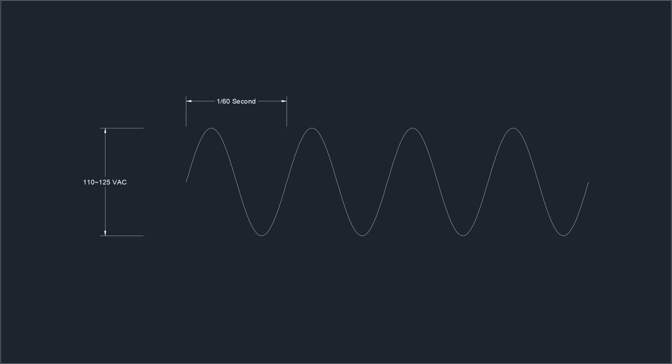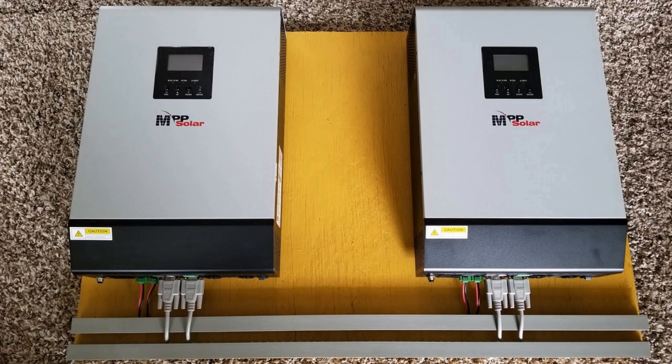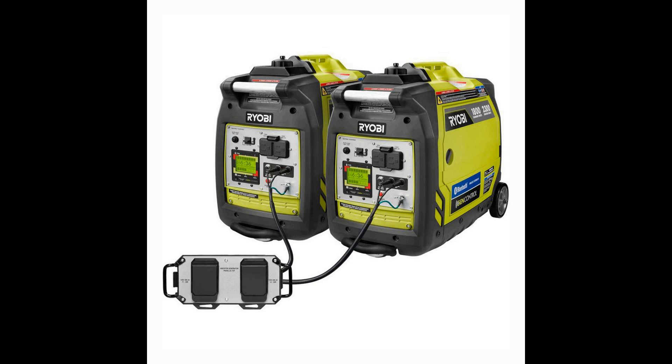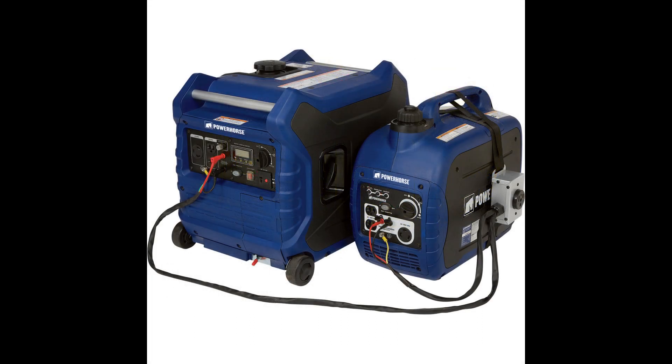The other great thing about inverter generators that conventional direct drive generators can't do is that they can be stacked — connected in parallel. Well-built inverters can be stacked: you can take two 1500-watt inverters, connect them in parallel, and you've got 3000 watts of capacity. The same is true for inverter generators — unless you've got a really crummy one, they can be connected in parallel and have their power capacities combined. Sometimes you can even mix and match sizes, though you've got to check what the manufacturer recommends — sometimes combining a 3000-watt and a 2000-watt is possible.